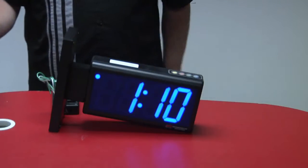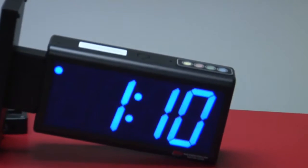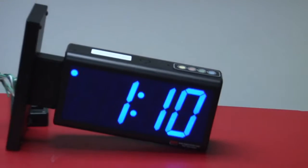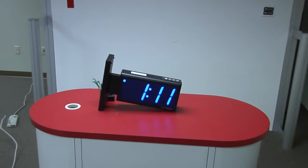The clock does not require a master clock. It operates independently utilizing an OCXO oscillator that is accurate to two parts per billion, or about one second over 20 years, essentially making it a maintenance-free clock.